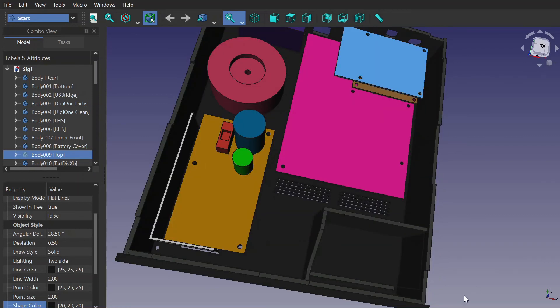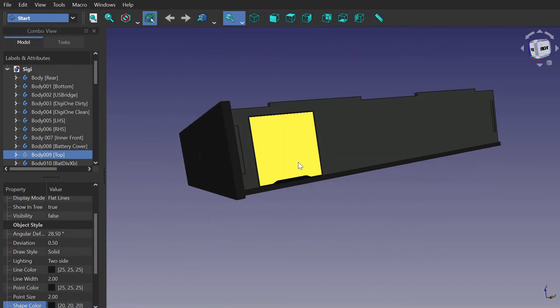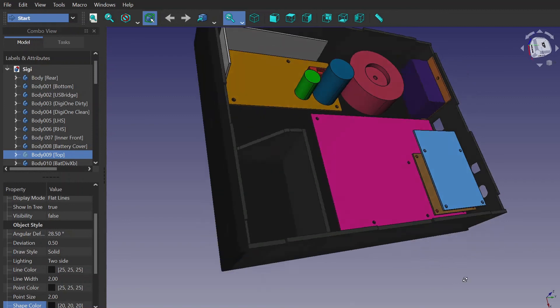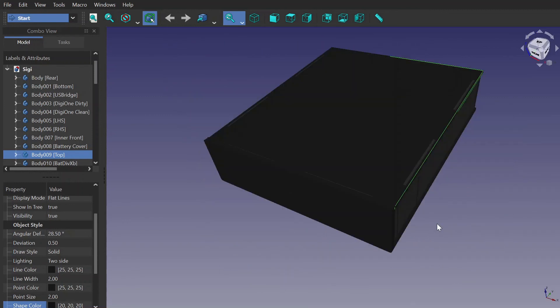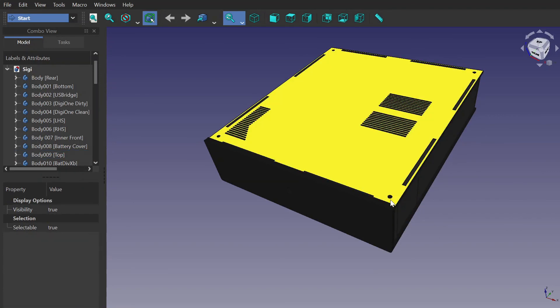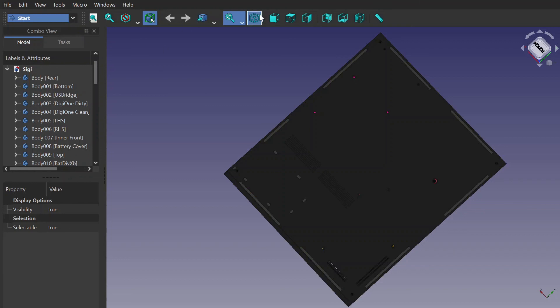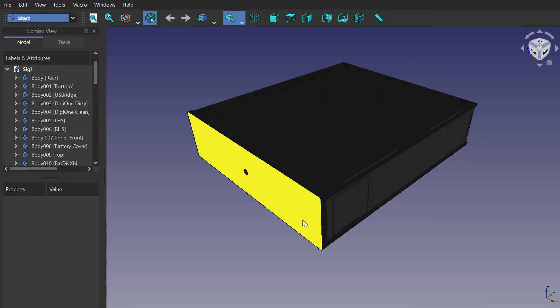Let's take the lid off again. This is the battery compartment here at the right-hand side of the front, with internal separators. There's a cover which will attach to the battery pack itself and will slide in and out to allow the batteries to be changed. I've designed in a slot at the bottom of the cover panel to allow a pull tab to be fitted for that operation. I chose mortise and tenon joints to allow everything to slot together easily. I thought of glue or pillars with screws at the four corners to hold everything together — hence the four corner holes top and bottom. For a fixing-free finish, the front panel was to be glued in place.